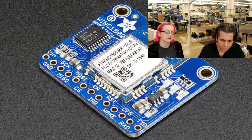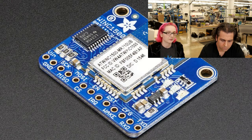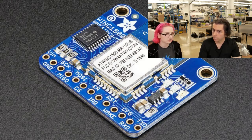However, the FCC ID is matched to a 2-dBi antenna, so if you're selling this product and using a different antenna, you may need to have some recertification done. Microchip manufactures an antenna that is the one used with this module — check the datasheet, they have a list of which antenna was used for FCC certification. But if you're using it for hobbyist uses, you don't have to worry about that too much. This is a great little module — it has SSL, you can upload certificates to it, works perfectly with the Arduino Zero, and works pretty well with the Arduino Uno as well.